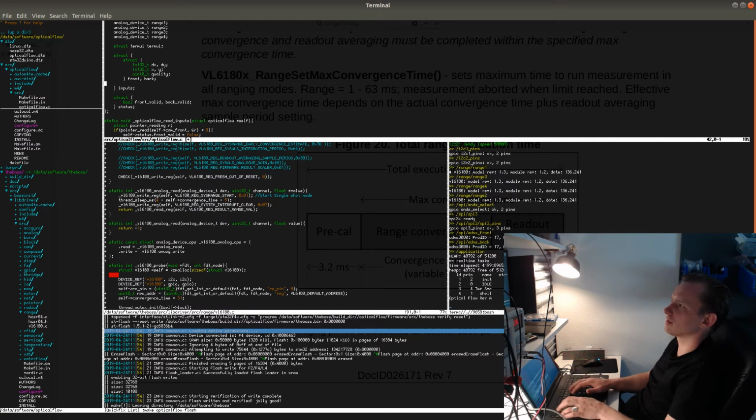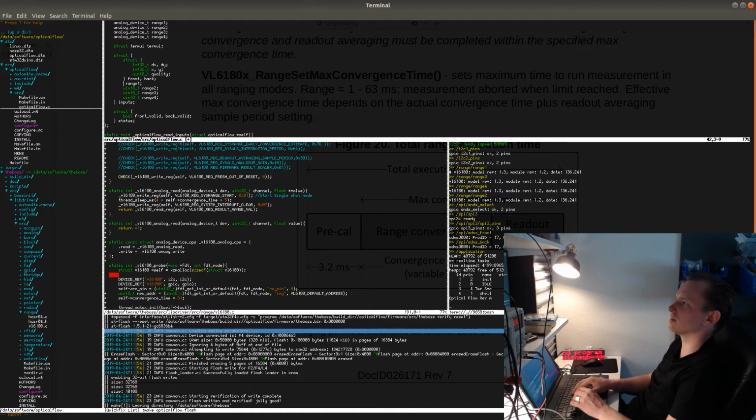Or actually, I'm gonna save them here, but I'm gonna save them as floats because I want to keep all of the interaction with devices in one function and any calculations in another, so that I don't interact with devices randomly in code. Because every interaction with a device connected to the chip is potentially a long time operation. So I want to keep track of all the operations that can potentially take a long time in case they eventually time out, and keep them in one place, so that if I need to add any monitoring for that, I can easily do that later.